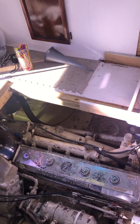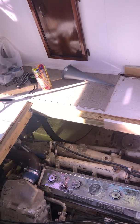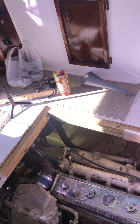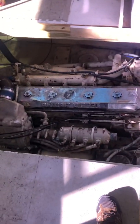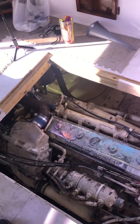I don't know if that's good or bad, but from what I hear that's sufficient to find a leak, even if it was something we had to heat up. So we are going to heat that up, get it a little bit hotter, pump it back up and see if that's leaking. If not, we're gonna pull the head off — maybe there's a crack in the head, we're not sure. We'll just do one thing at a time.